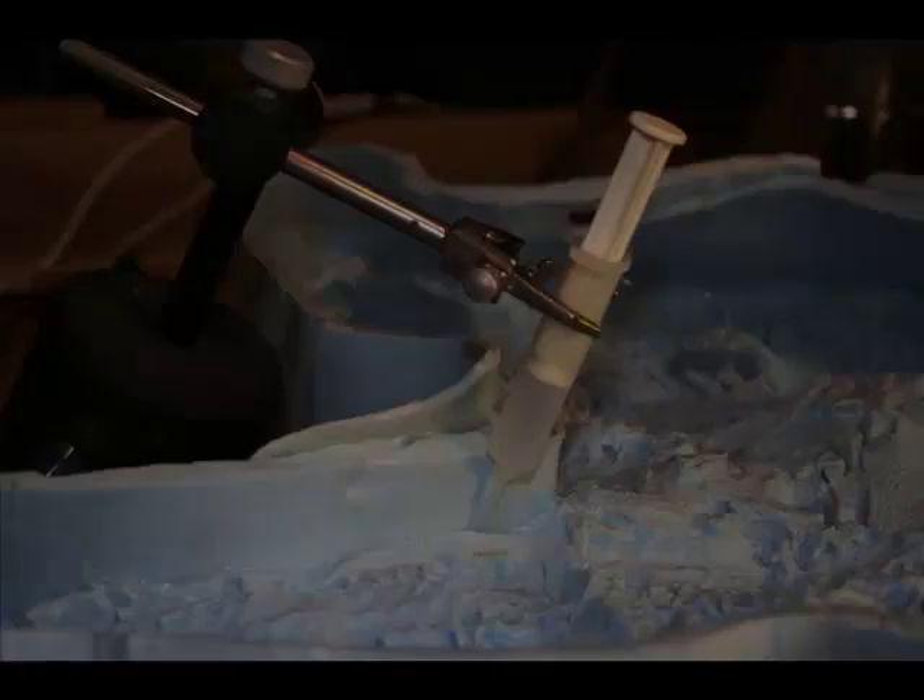This shot shows filling the seam. This is the registration bolt, and there's a seam that is filled with small batches of rubber. But after spending all that time getting a superb impression, the last thing you want to do is spill tiny drops of rubber on it. So what I'm showing here is a glue injector held in place with a stand. I'd fill the injector, set it all up, and not touch the plunger until I didn't have to worry about making any drips on the registration surface.